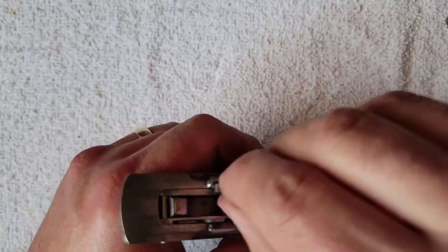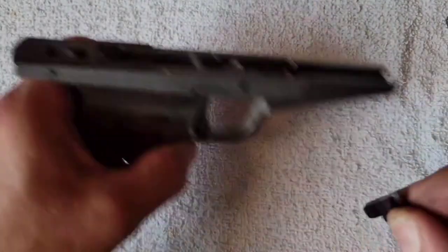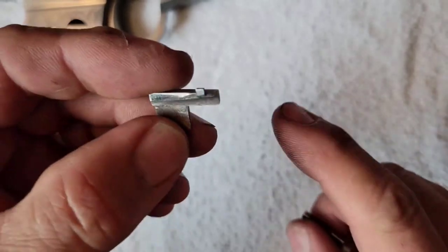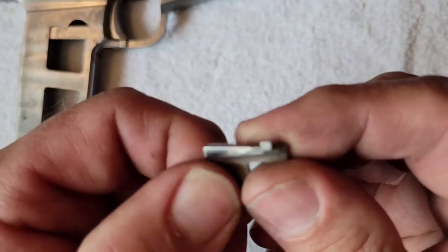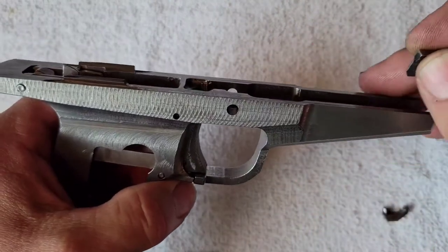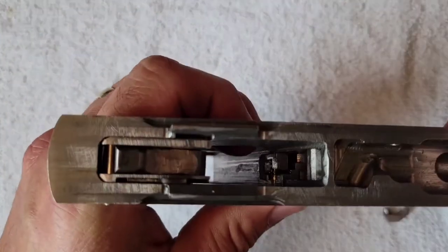When I made this original ejector it was an afterthought. I had not originally intended this gun to be magazine fed — I just wanted to know what it felt like to fire with the slide on an angle to the barrel bore axis. So I added a slot between the fire control group and the frame.